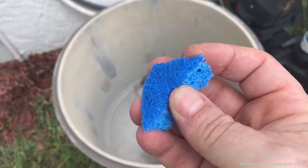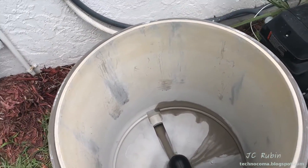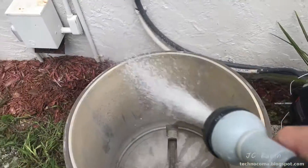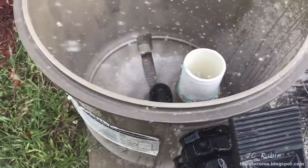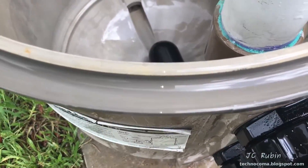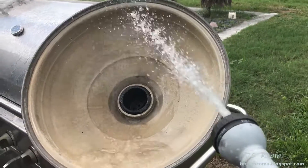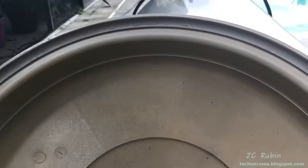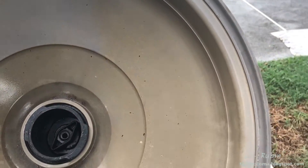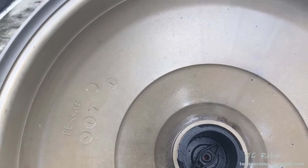This is all dressed up. I have a small piece of kitchen sponge — a soft scrub sponge — and I'm going to use it to clean the mating surface for this large O-ring. I'll scrub now, then rinse. It came out very nice. Same procedure here for the inner lip of the top cover. That makes a big difference. This inner mating surface is now done. If you had leaks coming out of the top of this, it's either caused by a bad O-ring, which could easily be replaced, or this surface being extremely dirty and not making a good seal.